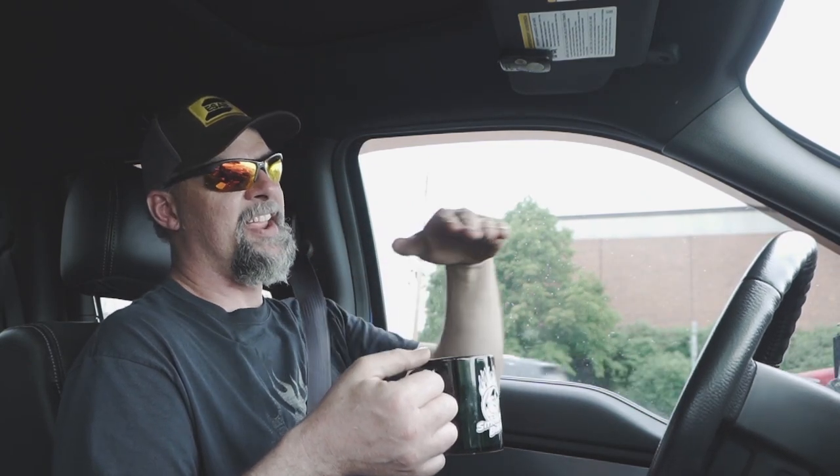On an open air offset, we're going to wind up mounting the firebox about 50% up the side wall of the cook chamber. The main reason is we're trying to get the air mass to go straight up in there — we want to cook from the top down on an offset. Otherwise everything would come right out and that end of the cooking rack would just get roasted. So we put a throat baffle on there, raise the firebox up a little, and cut that throat opening wide open so it doesn't cause any restriction.